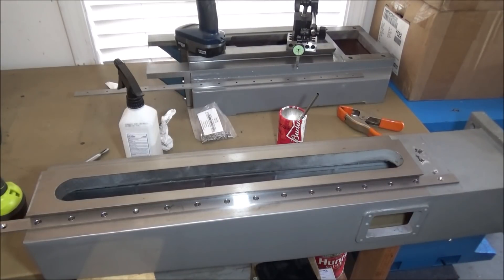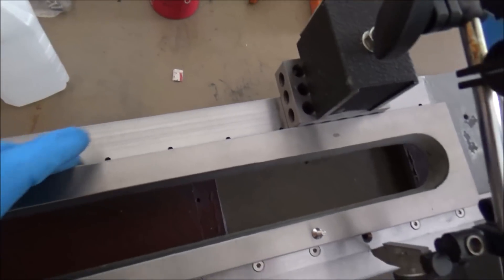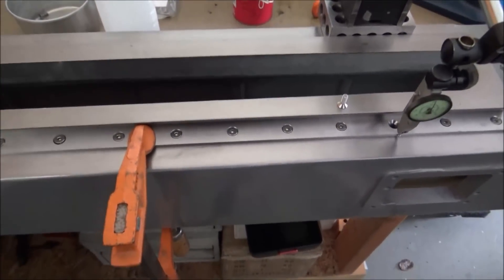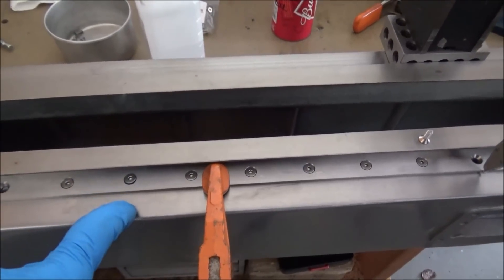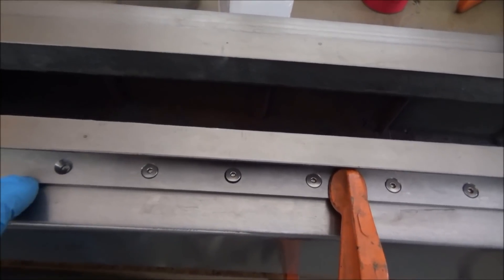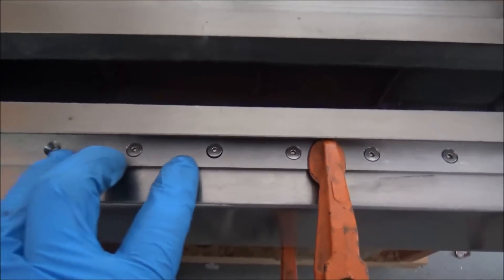I'm going to turn it around and get set up for the opposite side. Both sides of the datums are drilled and mounted and I've checked everything. I've removed both datums, cleaned all the surfaces, and hit it with the stone again to make sure there were no burrs created when I drilled the holes in the column. That hole I had trouble with — I spoke with my buddy about it and he said 'yeah, we call that hitting the ball bearing.' So we'll just leave it at that and not bother with it — it's just the datum so it'll be okay leaving that screw out.